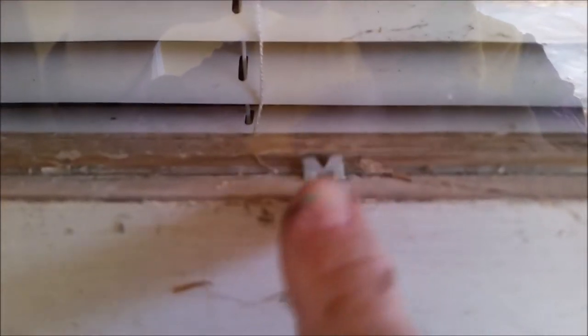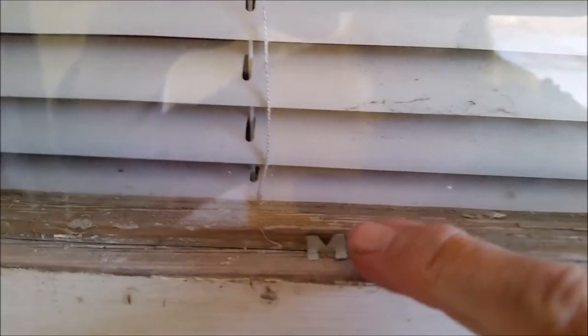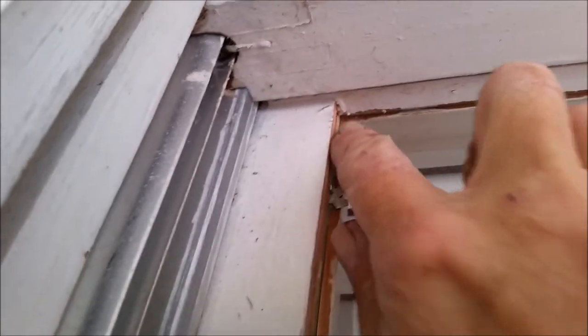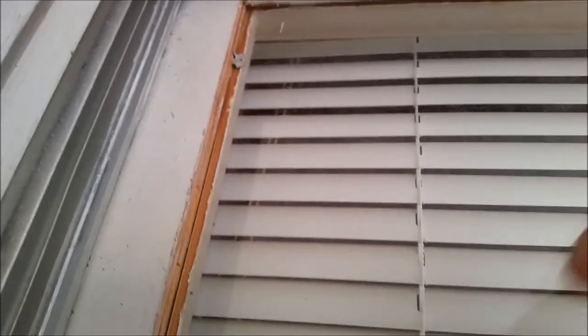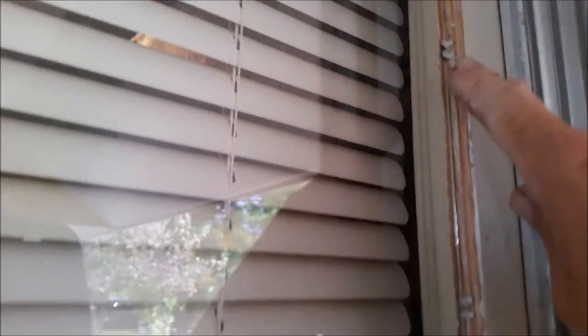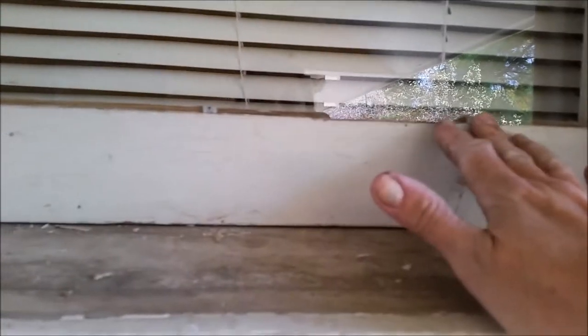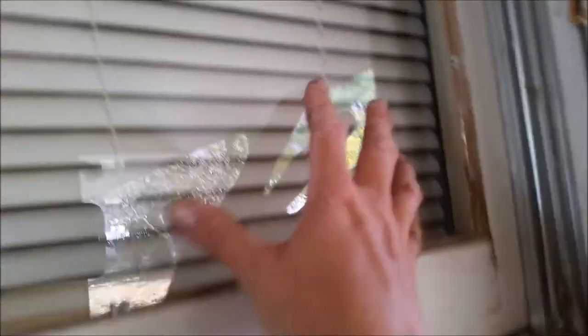That little letter M shape is a glazing point — it has a point at the end that allows you to push it in, and a little notch so you can slip a screwdriver head in to help push it in. Most of them went in pretty well, though one is a little bit crooked. The window glass sets right up in this groove. If it's not cleaned out, I just took my knife and slotted screwdriver and scraped until it came clean. Make sure you don't have any hard glazing material or caulk around the edges creating a high spot. The top part doesn't need glazing points because the slot holds it in. I did four along the sides and three along the bottom — for $12 this is all in and we just have to hit it with caulk.